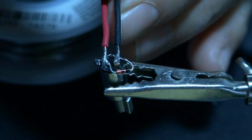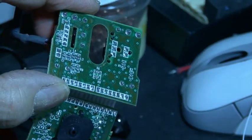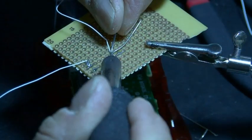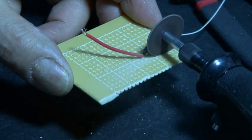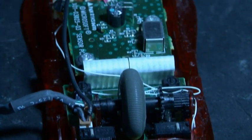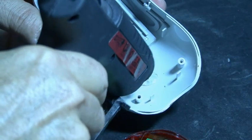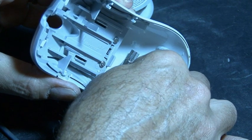Then it's time to make the solder connections to our little pager motor, including a little diode that goes across the contacts. Now it's time to dig a little bit deeper in that mouse, so remove any other screws, because we need to get to where the left mouse button is. We need to find the contacts there and solder a wire to the floating pin on that contact. All the main components were in place, so it was time to make this perfboard a little bit smaller — using my Dremel, I cut it to a nice small size. One more connection on the board, and then the two connections that go to positive and negative on the USB cable. After finding a little spot for the circuit board, it was time to tuck in all the wires. The final step is to get our pager motor in place, so I used some hot glue to mount it in the open area in the back of the mouse.